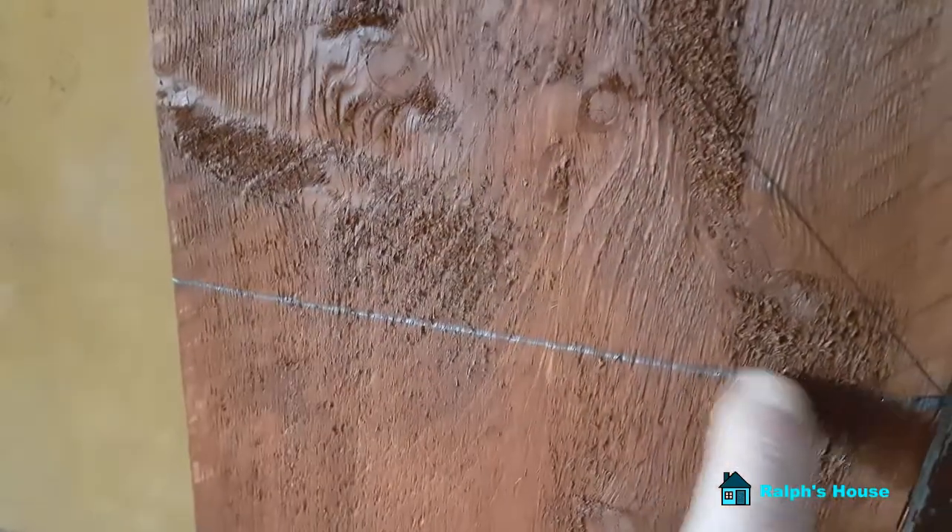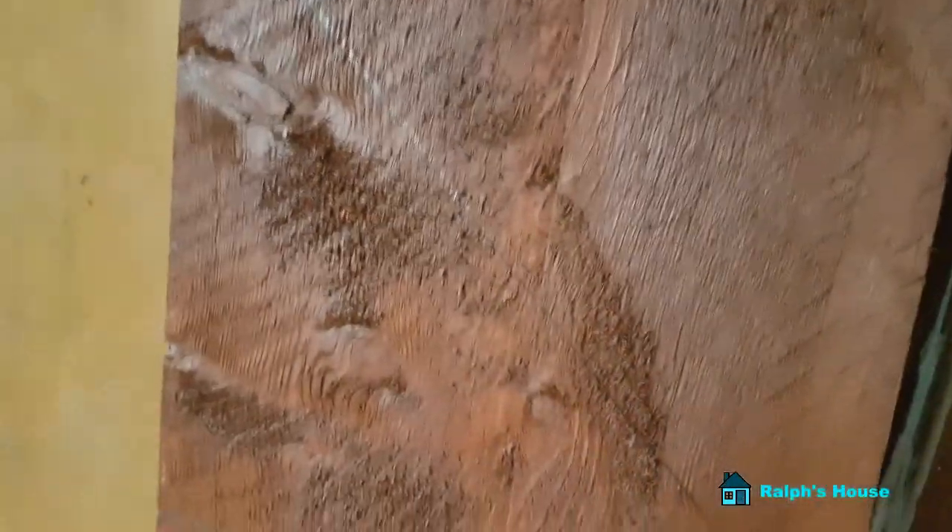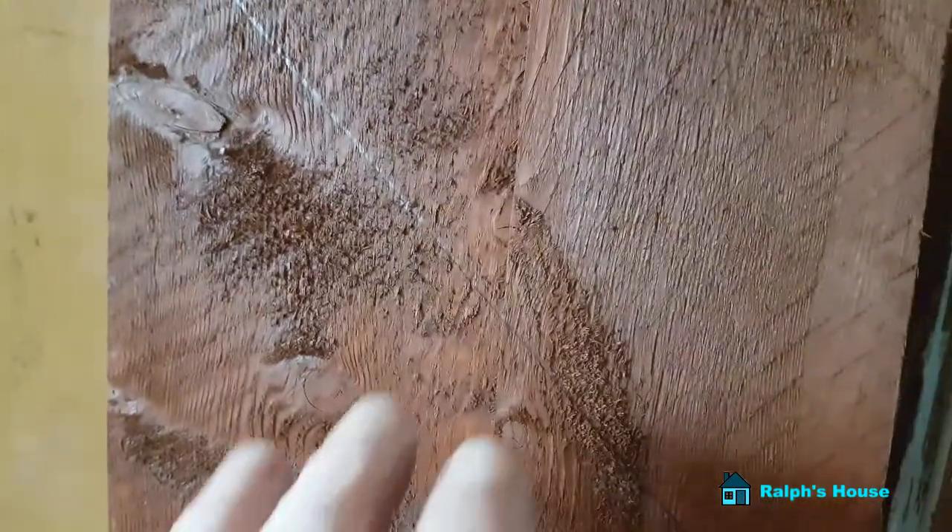Yesterday and last night I was painting the boards with that stuff. Because it's twenty-two wide, I've measured twenty-two from the end, drawn a diagonal line, and I shall cut that piece off — and do that to every piece. I should be able to join it all together like a picture frame, and I should have enough left over to put a block under each join where it sits at the end. Scaffold boards — pretty sturdy stuff, and I should be able to walk along it.